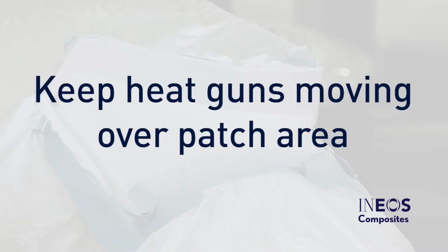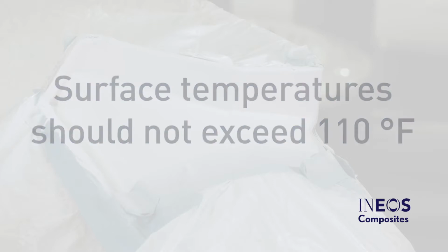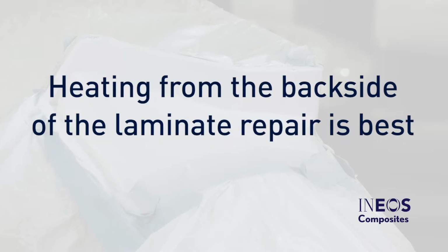Heat guns can be difficult to use. The heat gun must be kept moving. Surface temperatures should not exceed 110 degrees Fahrenheit. Heating from the backside of the laminate repair is best.